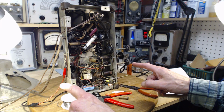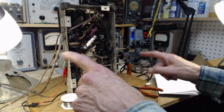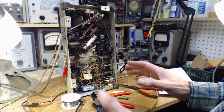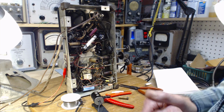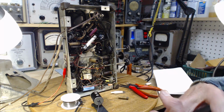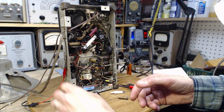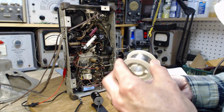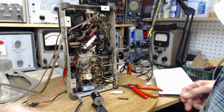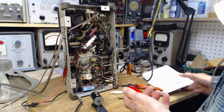So our ears don't hear the same response curve, if you like, although I'm showing a straight line here. It looked like this more. We have a different response curve at different volume levels. So to compensate for that, they make arrangements so the treble cut kind of disappears on low volume settings. That's my understanding of how this is working. And this gives the loudness effect. On some stereos, there's a loudness switch, and what they're really trying to refer to is this problem of low volume settings, where the tonal quality disappears in our ears. Especially mine, wax-filled ears that I've got here. Okay, so 0.006 is the one we're going to put in.